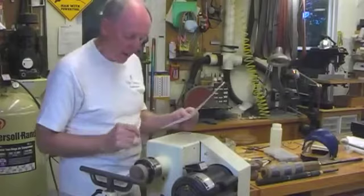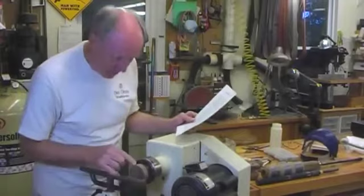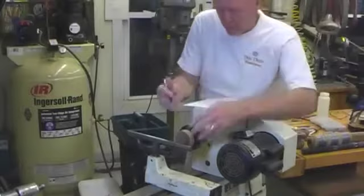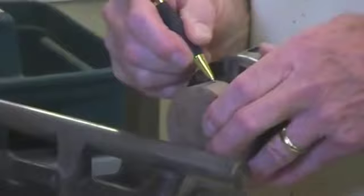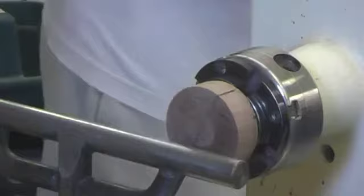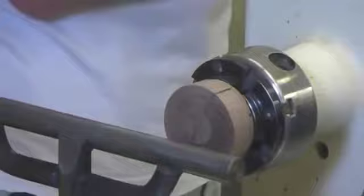Don't forget the grain realignment mark. Okay, we've got it marked all the way down through the middle, and we've got it marked up here. So, once I face this off, what I have to do is make sure this comes back all the way, because I'll probably get carried away. Because I'm going to make a tenon, and part of that mark was going to disappear. All right? Dividers. We have a hole, and we're going to mark the size of the tenon.